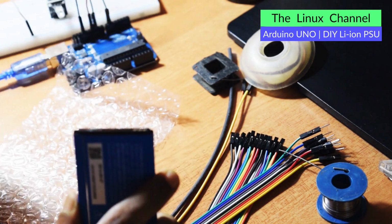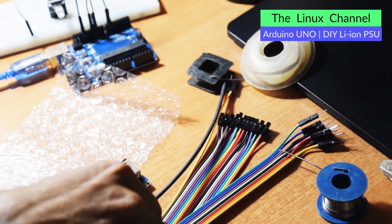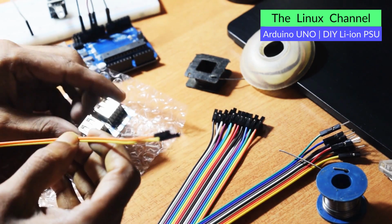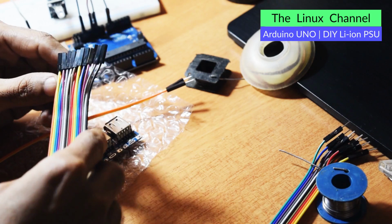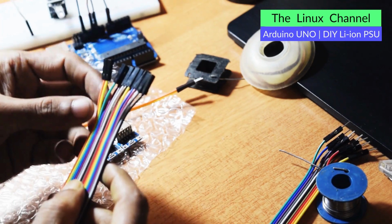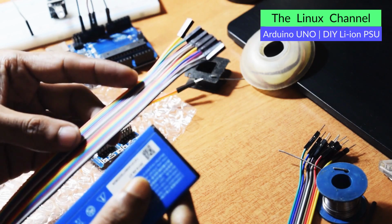So I thought let me make it a bit modular. I got these regular jumper wires and this heat shrink. I can solder this part and expose these pins, and on the battery side I can solder one of these, which is the female part. Somehow I can mate these things and make it work. And if I want to change this power source, I can pick some other battery and then shift. So that's the basic idea.